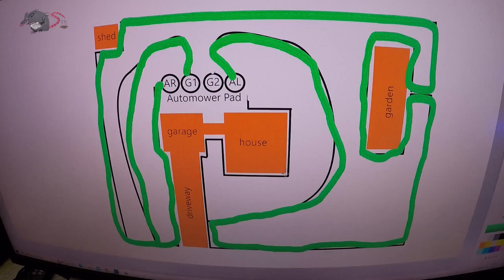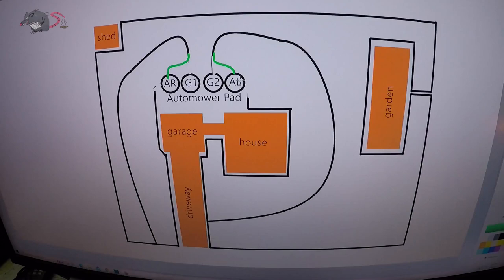I'm not saying that just because you know where it is you'll find the break just by walking it, but that's typically what I do. I narrow it down to a section and might come along here and find that somebody did some gardening and punched a shovel in the ground, or there's a rut in the driveway where someone drove off the edge — I'd look there first for a broken wire. Maybe somebody changed the landscaping, or maybe I find a hole where someone was digging. There are a lot of possible obvious things, and there's also connectors to look at — things you can check without any specialized equipment. It doesn't matter what combination you change on the back here; the active terminals are the two outside ones, and if you have a connection you're going to get a green light.